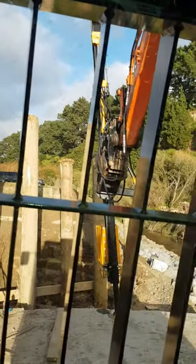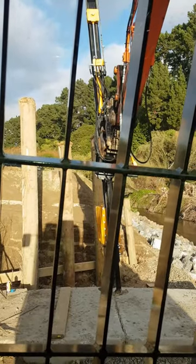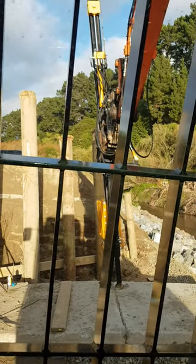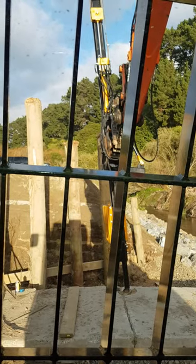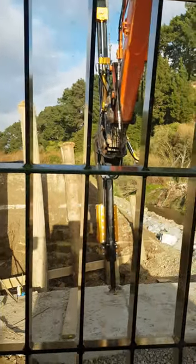The reason we need that is this digger has got a tilt coupler, but because our hitch is on a 45 degree angle — which we need so we can get the right angles out of the machine — you need a parallel tilt, which this gives you, to get it nice and square.